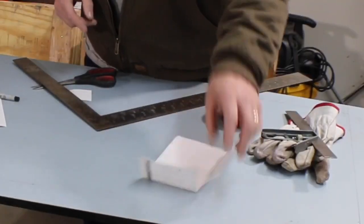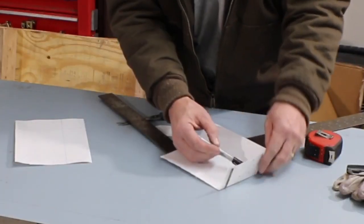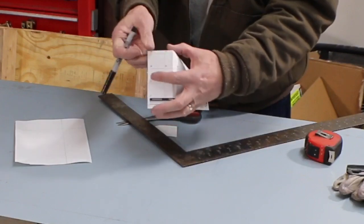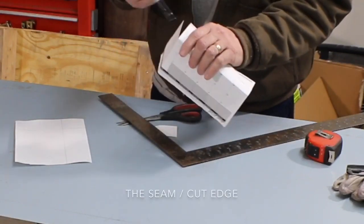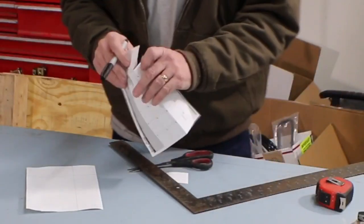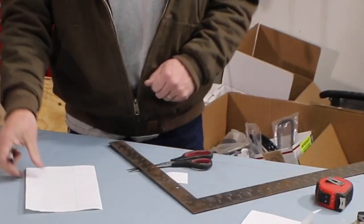You could do it from the inside or the outside. If you did a weld on the inside, you're going to get some structural strength, and it's going to leave a very crisp edge out here, but you're going to see the opening, the crease, if you will. If you welded it on the outside, you're probably going to get a rounded off weld, and then you could try and grind it to a point again.